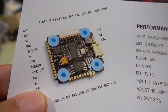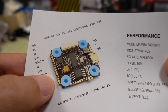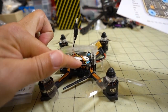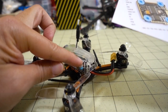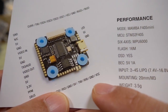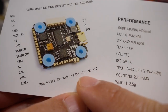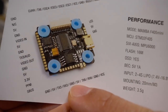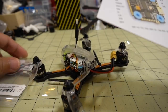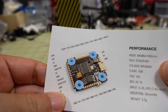The board here has a nice little diagram. All the solder points on this side correspond to this side of the board over here. I need to get into the back of the board to these four pins. There are two large ones — that's VCC and ground, which I'm not going to use. We're going to use RX-6, TX-6, 5 volts, and ground — those four pins right there. That's all you need to wire up the GPS to the flight control board.